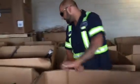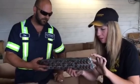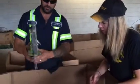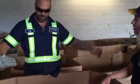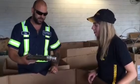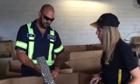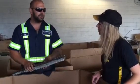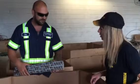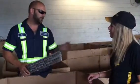This is what we call a copper aluminum rad end. This is all copper, and over here is more copper, and there's aluminum, and this part is steel. At one point this was part of a radiator — a copper aluminum rad. Customers cut the end off so they get paid clean for the copper aluminum rad, and then this is worth a separate price. Something like this we're paying right now about 35 to 40 cents a pound. It seems crazy for something with such a little amount of copper, but clean copper is in the mid-twos right now — $2.35, $2.40. Anything with copper is worth more. You never want to throw copper away — even a small amount is always worth keeping separate, because it's always worth more than throwing it into your steel pile.